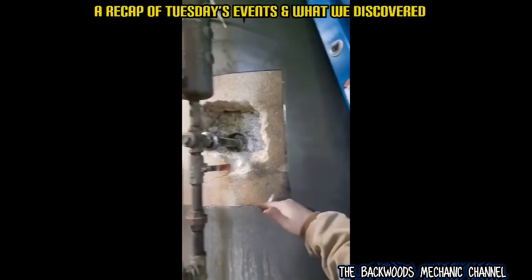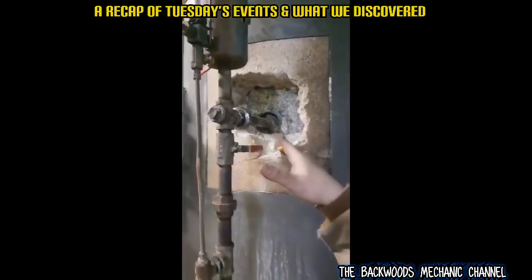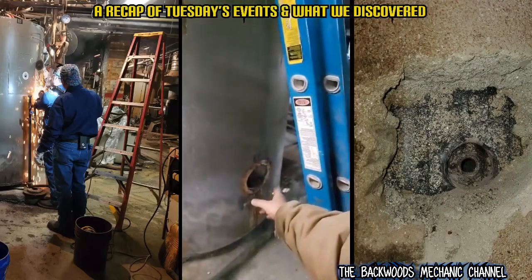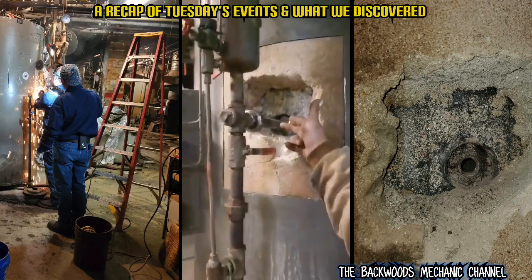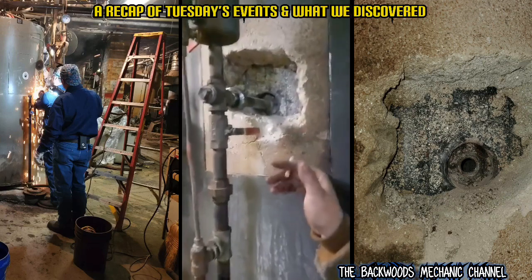Generally you can take the outside shell completely off these machines, but on this type of boiler you'd have to take everything off - the pipes, the box, the wiring, everything. So instead, what we essentially did was take a grinder and cut a square around it, because we knew the spot it was leaking at. It went to the top side first, then the bottom side. We replaced the union, put new pipe on it with pipe dope, and it was still leaking like a sumbitch.